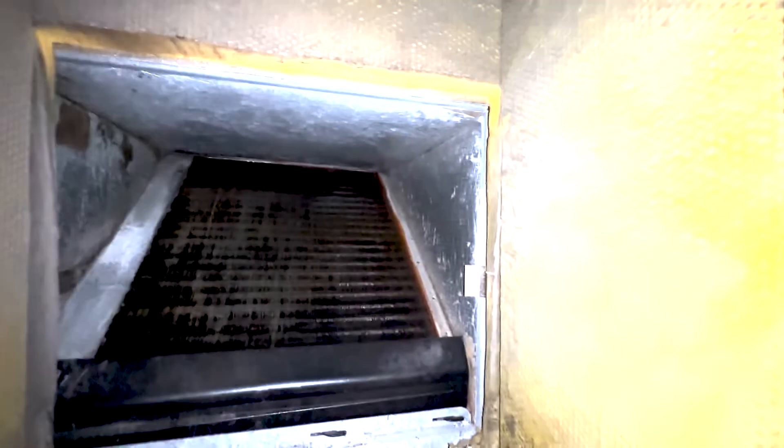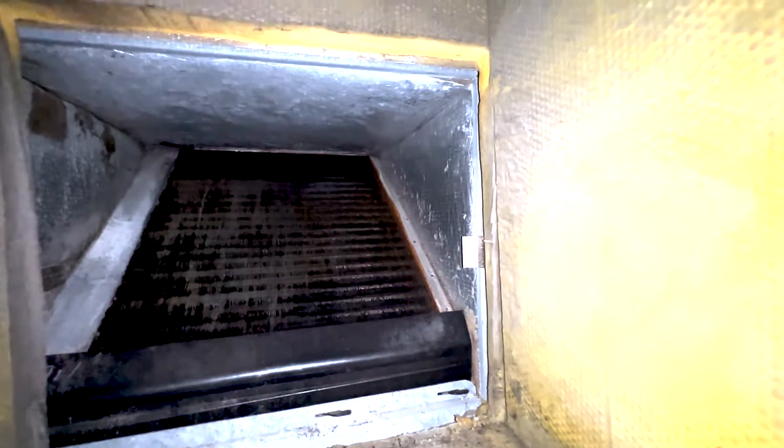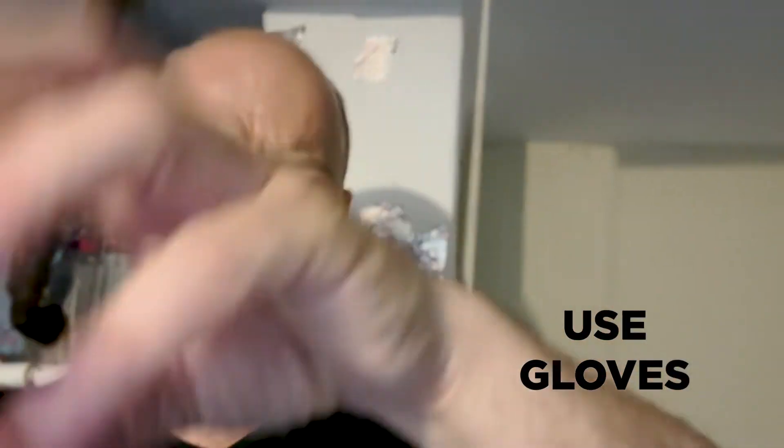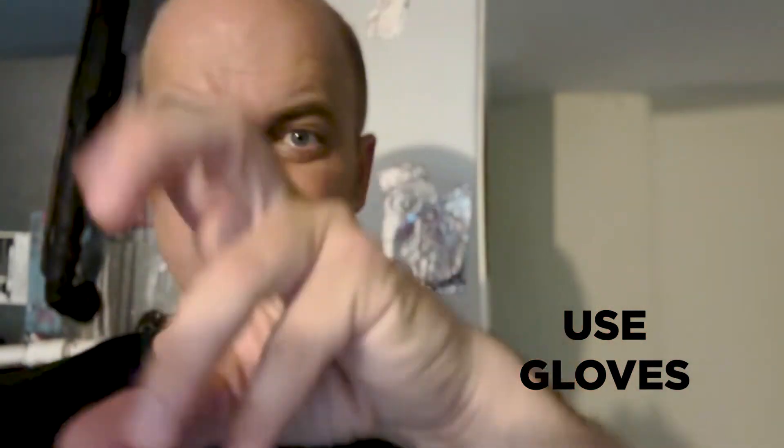The power's off — make sure the power's off. You don't want to be sucking a bunch of air in here while you're doing this. Before you spray, if you have large pieces of insulation or blocks of hair on the coil, just pull that stuff off first. I would wear long sleeves so that if your arm touches the insulation, it doesn't get on your skin too much. Even I try to wear long sleeves when doing ductwork so that stuff doesn't irritate me.